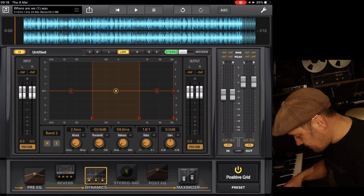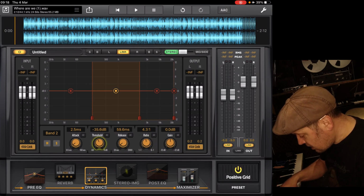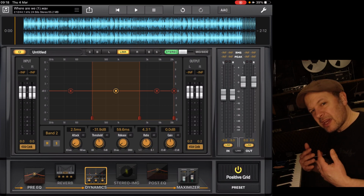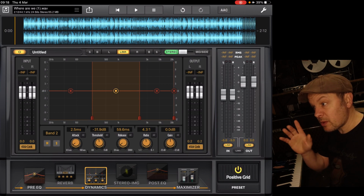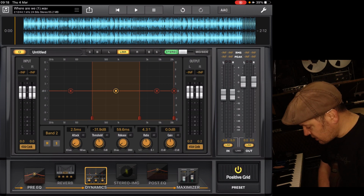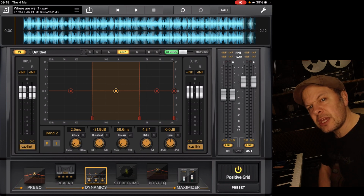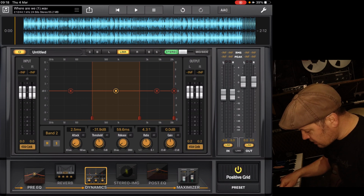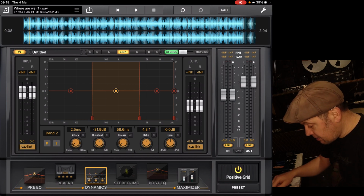Yeah, okay. I hadn't set the ratio, which is why I didn't see the gain changing. Now, what we want to do is to keep a real good hold over levels, because it was distorting. It completely went into oscillation there. So you actually have an input and an output control on each stage, which is really handy. So I'm going to take the output down a bit, just so that I can keep a level on this.